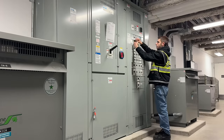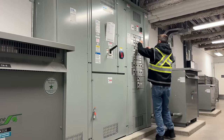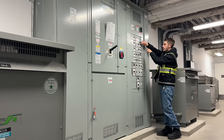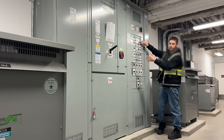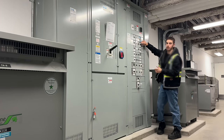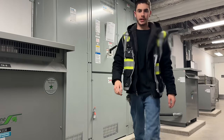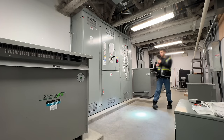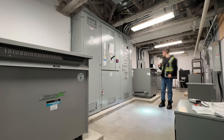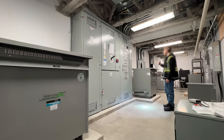We're going to first put our emergency power back on, and then our second transfer switch, and then it can fully enter its cool down period. It can't enter that period if one transfer switch is still calling for emergency power — it has to happen one, two, three. There we go. So now shortly we will transfer back over — we're still powered on generator power right now, but once it decides power is stable, the transfer switches will throw back over to utility power and the emergency lights will drop out again temporarily.